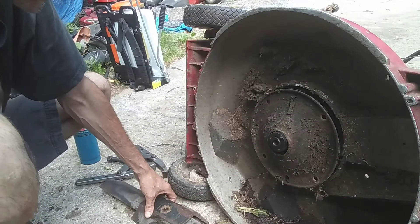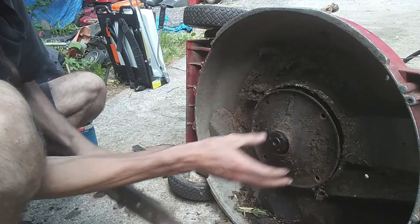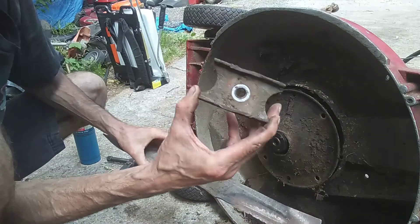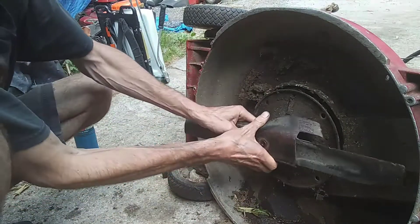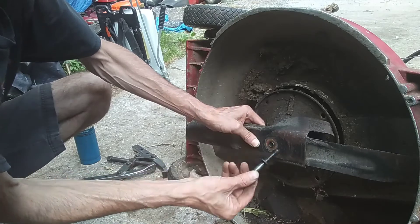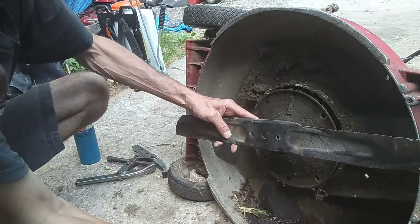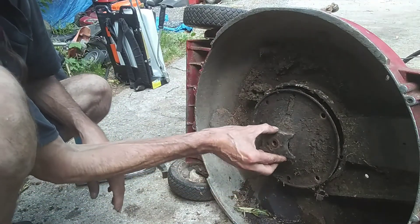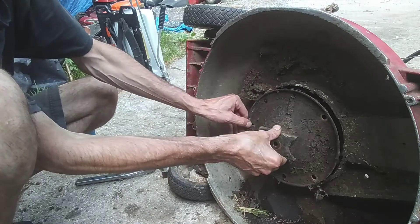A bunch of these recyclers have this kind of setup here where you've got this cover plate that sits on, then the blade adapter goes on — of course, this one's broken. It fits in here like this, and then you've got your stiffener and your nut. So the first thing to do is get the blade off, which is no problem. Impact or however you take your blades off, get the bolt off, then the stiffener should come off and then the blade should come off. But this piece right here should still be attached to this, and if the blade adapter is stuck on there, you can't get this cover off.